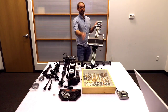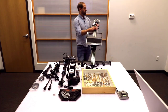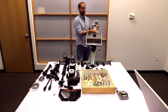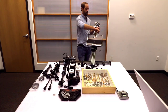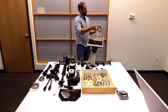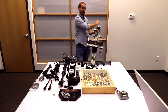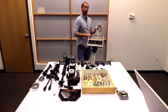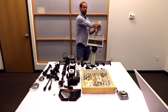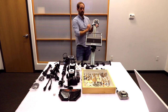For the insect box, it's actually very likely that you might not even use this. But for the soil boxes, which might be five kilograms at a time, you can actually reduce the weight by connecting the tool holder right here to this cable — this is basically just a clamp. You can disconnect this and it will recoil back up. If a box is quite heavy, you'll basically disconnect or reconnect this tool holder as needed. This particular tool holder is a four to six pound load relief. Right now it's at four pounds. You pull the center mechanism outward and then it will unwind — that allows it to put less force on the box. If you need more tension for a very heavy box, you'll spin this mechanism counterclockwise, and that is going to give you a little bit more load capability.